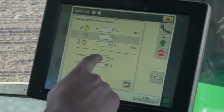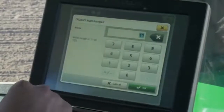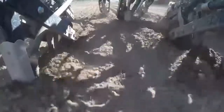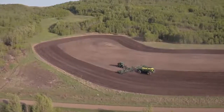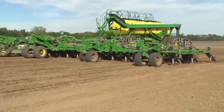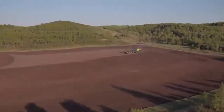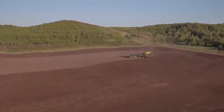Access the press wheel downforce section of the screen. The settings can be set just as you set trip force — upper and lower alarm values can be set, along with pressure increase and decrease using the plus or minus buttons. Setting the correct packing wheel pressure positively affects yields. If a customer is running in wet clay and packing wheel pressure is too high, it can cause actual smearing of the soil during closing. Smearing of the soil can affect yield by robbing the seed of available nutrients or pushing the seed out of the soil completely. The 1870 Air Hoe Drill has several settings that can be easily adjusted from inside the cab to match a wide variety of soil conditions and crops.